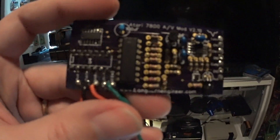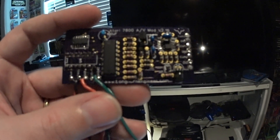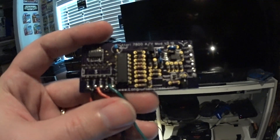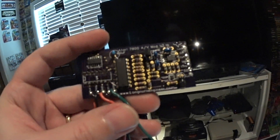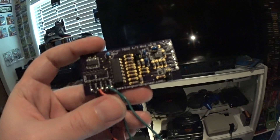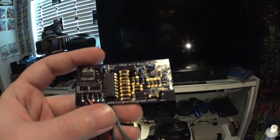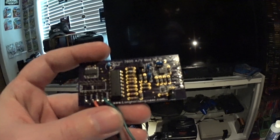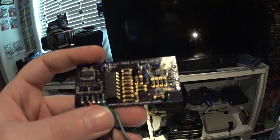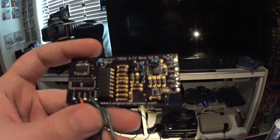Then I upgraded to this little guy right here - a pretty complex mod board known as the Longhorn Engineer mod. It combines component, composite, S-video, and a refreshed audio circuit line. It worked pretty well; the composite was decent although I still had bad jail bars on the edges and lots of color fringing or color bleed. Detail was lost in both composite and S-video, but strangely connecting both at the same time to my AV system actually looked better. On CRTs it looked really good, but since I do a majority of my gaming on a flat panel I was never quite happy with it.